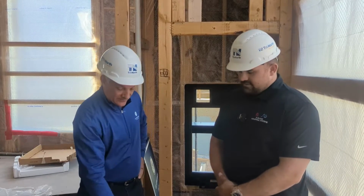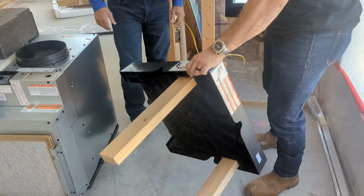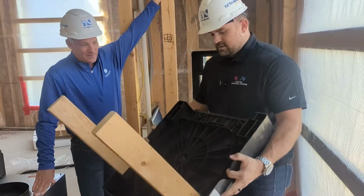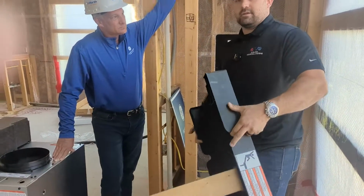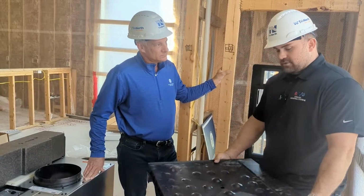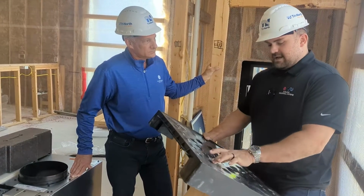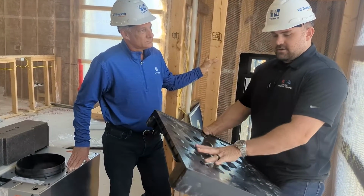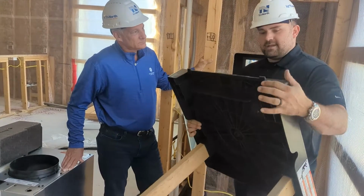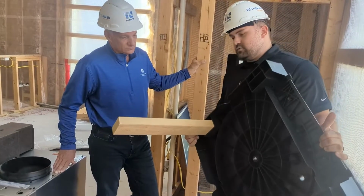So now, I know a lot of what you said they were interested in was the platform. Tell us what they really liked about it and what sold them on the Insta platform. Yeah, so I actually was not familiar with it when I first started specifying this job. What I learned and conveyed to the contractor was you didn't have to do any extra plumbing. It's already here with 3/4 inch threaded connections. All you have to do is attach it. It's integrally rear supported in the back to the telescopic plenum, and all it requires is two 2x4s.